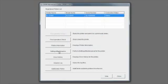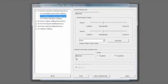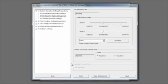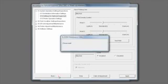To enable the sorter, click on Settings and Maintenance. You'll see settings for optional equipment — click on it. Just up from the bottom right is an area for the sorter long paper eject unit. With the sorter installed, it should show as attached but not yet enabled. Click on Enabled and then Apply. It will take a few seconds to communicate the settings to SureLab, then it will present a final dialog to confirm the new setting — press OK. Press Back to return to the main screen of the maintenance utility. This last step is very important: if any client PC connected to SureLab has the maintenance utility in an active state, SureLab will not print.